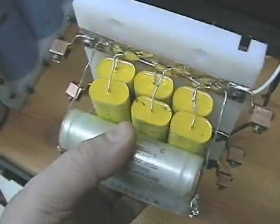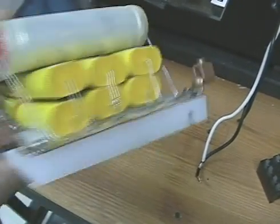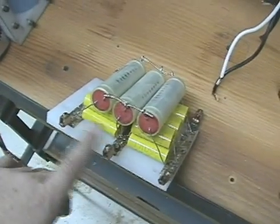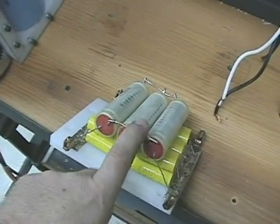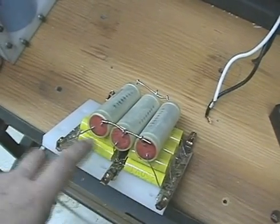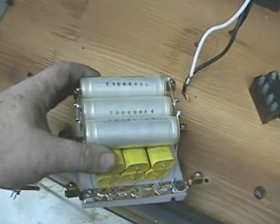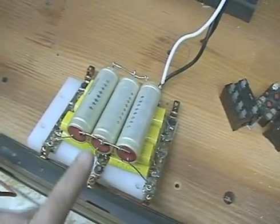These are polypropylene AC capacitors, 12 microfarads, and there are six of them across the phase. This is three phase here, wired six on each one. These are electrolytic capacitors tied to the DC side — the negative is tied to the bus and the positives are tied together.